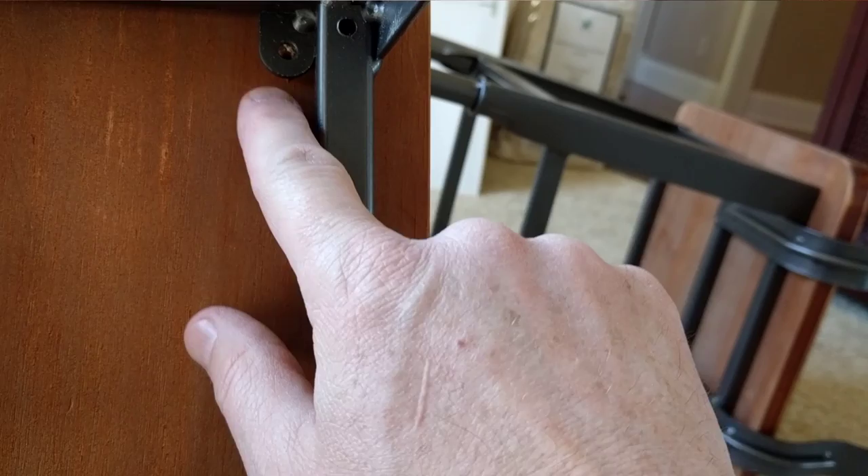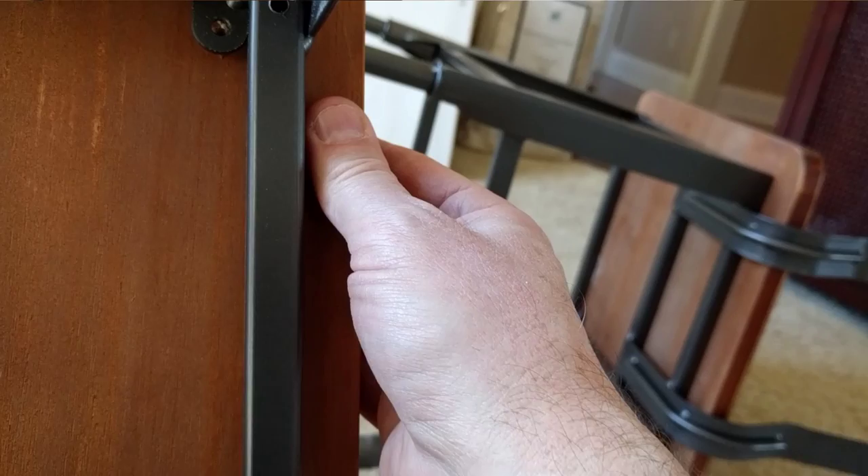It's good that you're drilling pilot holes. You should drill a pilot hole for the screw to go into so it doesn't split the wood. However, the pilot hole must not be bigger than the screw.